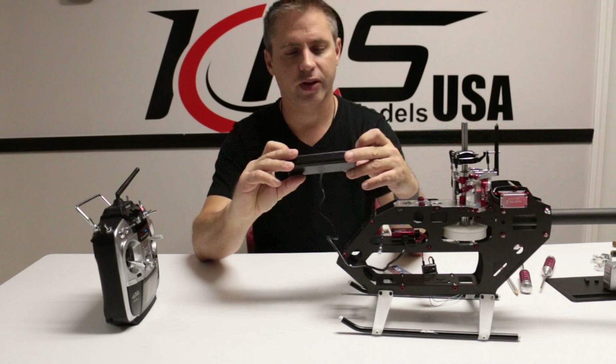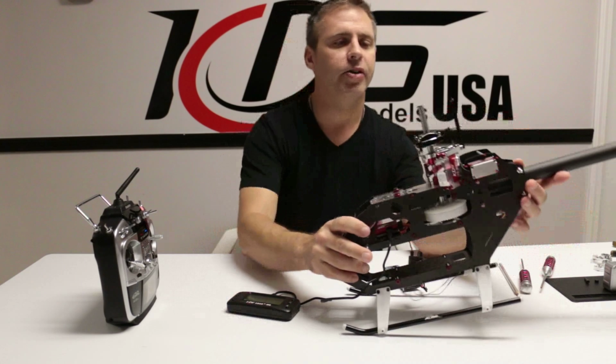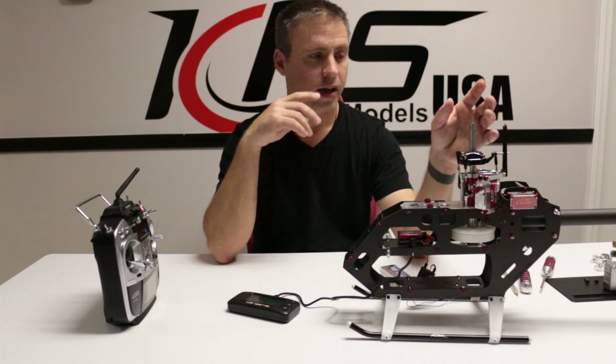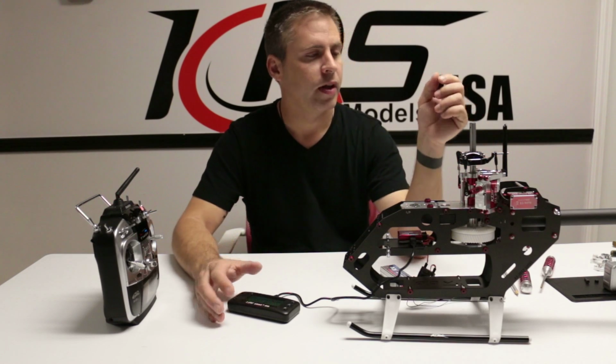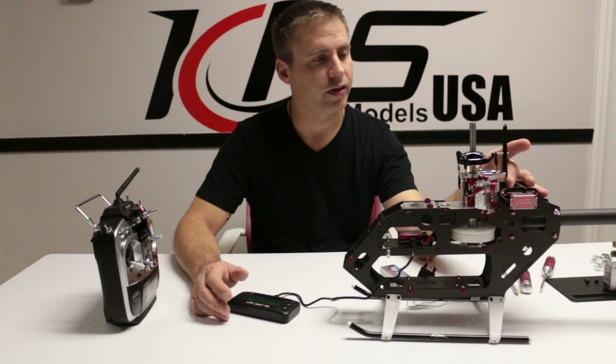So what I'm going to do is, in the first line is the bar monitor. I'm going to hit enter. And now in this menu, I basically disabled my gyro and my flight control. Okay? And so that's going to let your servos sit at a neutral position. Okay, so you're going to just snap on your servo arms as close as you can to center.